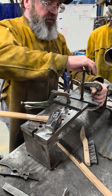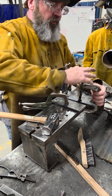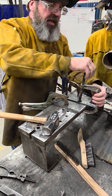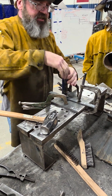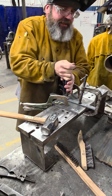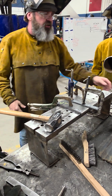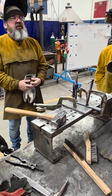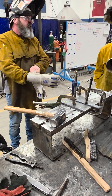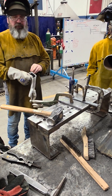You're not going to take the clamp off until it's all done and welded. This one isn't tight yet, just lightly snugged down. The tighter this is, the better. You want that backing strip as tight to those plates as you can get it. If there's any bit of gap in there, you're going to have a hard time getting good penetration. The tighter the better.